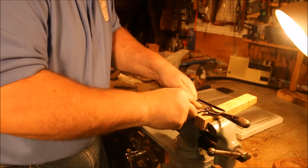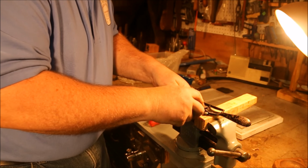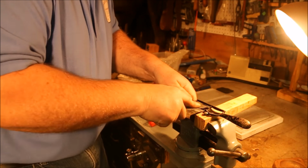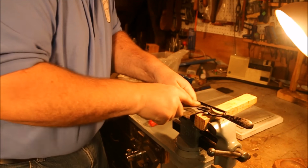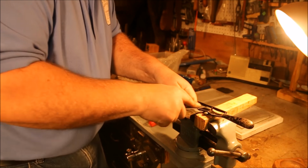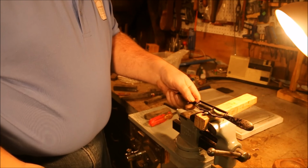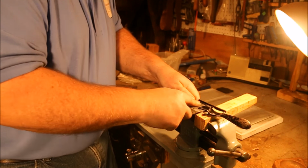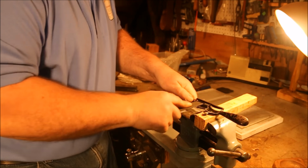And I bet this was never really even designed or thought of as being a flat surface. Because they put Japanning on it, which is a real heavy paint. And that is never going to lay flat. So I imagine this is not a high-end tool. Doesn't mean it can't be a good one. This isn't a high-end tool either. This is just a piece of steel that I glued some sandpaper to.